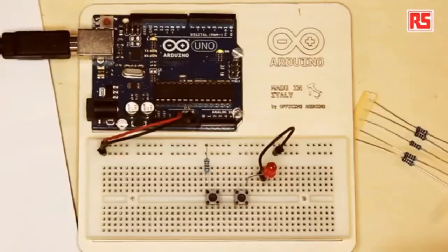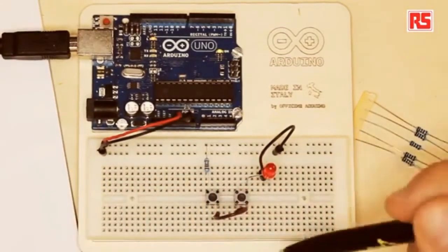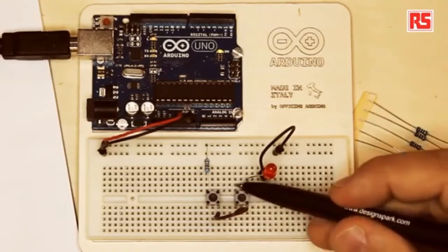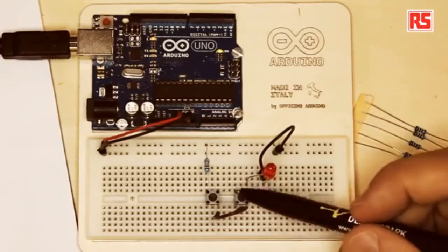I can mount a jumper behind the push buttons and the circuit still works. This point in the circuit and this other point are exactly the same. When I press the button, these two points are connected with the other two points. When I release the button, only the pairs are connected individually, but there's no connection between all four. This allows me to create what we call a parallel connection — placing one button next to the other to create two different paths the current can use to flow through.